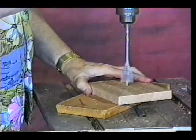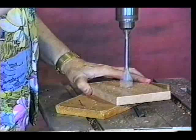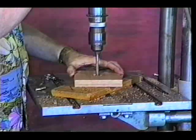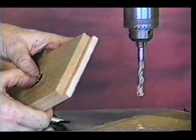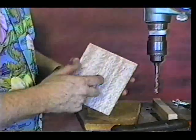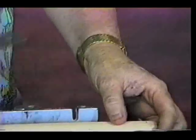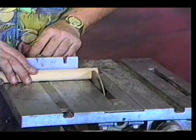Now we're going to drill the bottom piece for your tripod socket. We only drill about halfway through the wood with the spade bit, then we use a t-nut that fits into the center. We select a drill bit the same diameter as the t-nut and finish the cut going down through the center. The t-nut then fits into the bottom piece of the wood. We use a hammer and a little wood scrap and pound it into place. Then we cut a wood plug off a one inch dowel that fits into the hole we made for the t-nut, and it blocks off the back of the hole.